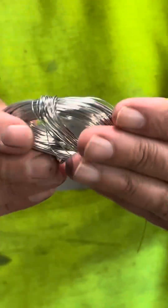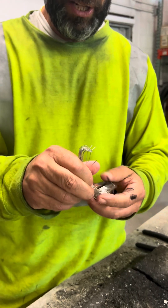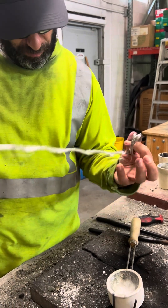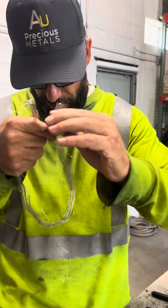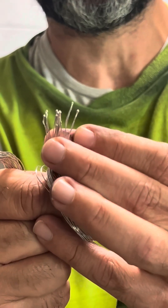So this is what they call Type S thermocouple wire. You have two leads that are attached here. One lead is pure platinum, and one lead is a mixture of 90% platinum and 10% rhodium. Can you see those balls in there? Where those connect is where the two leads come together.